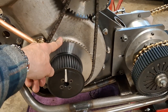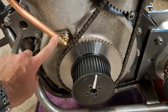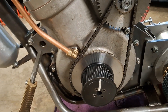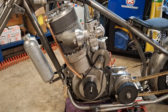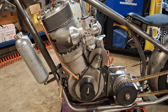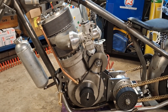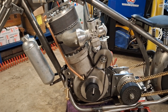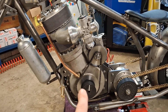What we found was that in fitting this sprocket we came across some unexpected things. The first is that the original breather hose — the great big Goodrich hose — didn't quite fit between the sprockets. So we had to reimagine the breather assembly. I've used household plumbing fittings and made an adapter. I'm not quite sure whether I like it or hate it — on one hand it's neat, follows the engine line, it's tucked in and has a one-way valve incorporated at the top. On the other hand, does it look a bit like you're plumbing?